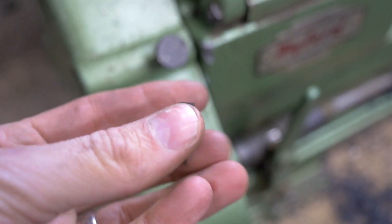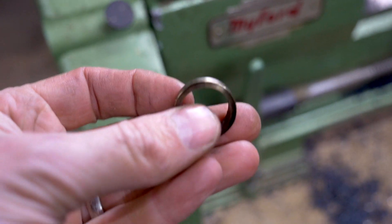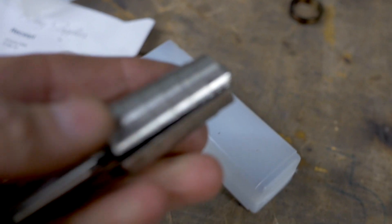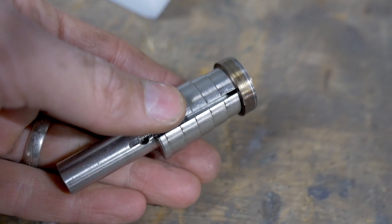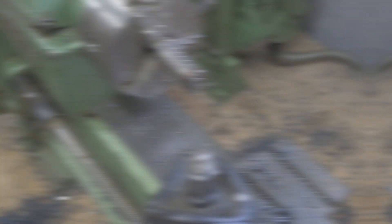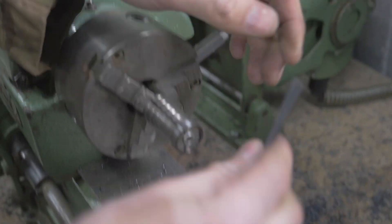We just cut it off. This is what the ring looks like. Now we need to put it on the mandrel and sand the edges — but that is the Damascus ring. We're going to sand it, put it in ferric chloride to see what it looks like, and then finish the ring up. It's lovely and light, really really light. This is the ring mandrel I purchased from Ring Supplies — I'll do a link in the description. What it allows you to do is take your ring, put it onto the end, and expand it so the ring stays on. I'm going to put it on and sand the edges so it's all nice and clean. I'll put this into the lathe — just tighten this up so it expands. Ring's on there nice and tight. I'm going to get some sandpaper and just sand it lightly on both sides.